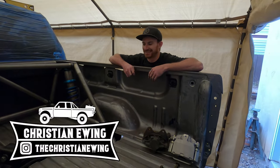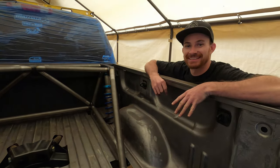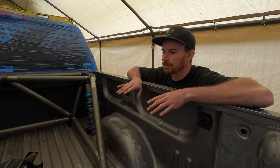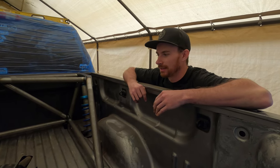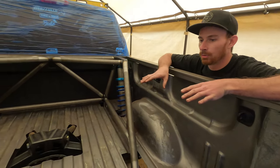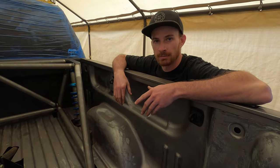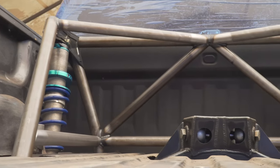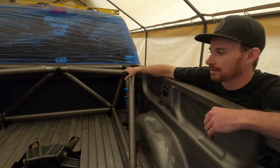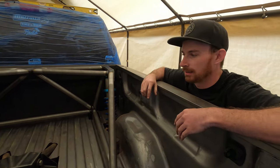What is going on with the back of this thing? So this truck — if you guys saw the walk around video — the rear was leaf sprung before, and Aaron got into a little accident out in the desert last season and pushed the bed in a bit. The whole leaf sprung setup was not set up the most ideal way. He wanted to ditch that entire setup and start fresh. He wanted to keep a whole bed so he could still throw a dirt bike back there and use it as a normal factory bed, but he wanted the ride to be better. So we decided we were going to do a short course inspired link setup on the rear, with a really simple leaf-sprung inspired bed cage, just to keep as much space as possible while still having it work and ride really well.